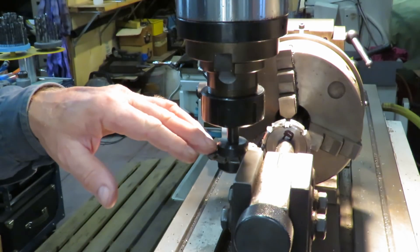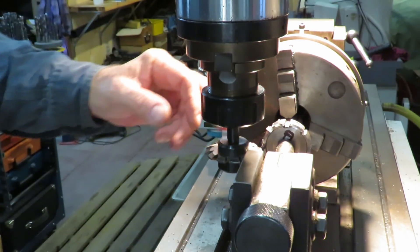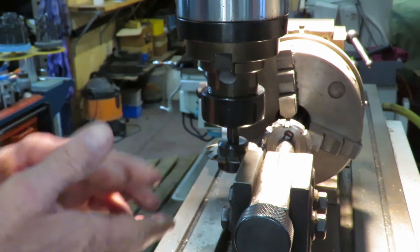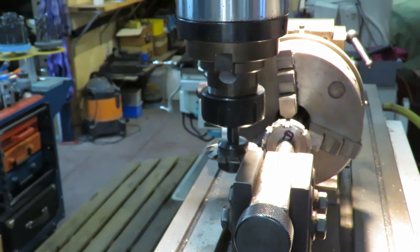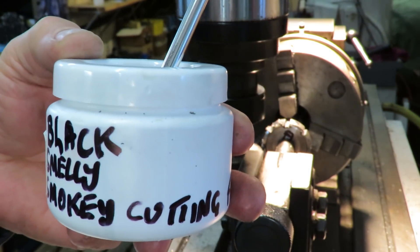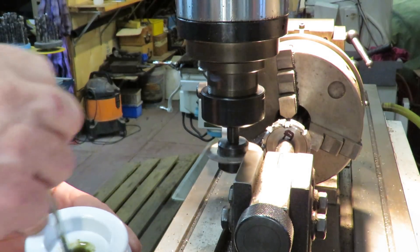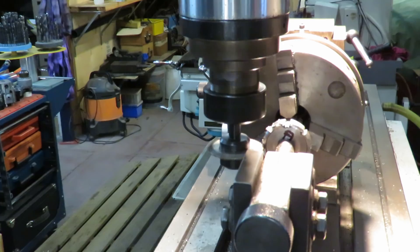We've gashed the centre cut. Now we're shaving. As we go and we're advancing, we go around the 8 teeth, shave off 3 degrees, then go up another 3 degrees, and we're working in reverse. It'll probably be quite a bit of noise from the mill, but it is what it is. I'm also using a bit of my black, smelly, smoky cutting fluid — doesn't need much. The material itself is 4140. And now we're shaving.